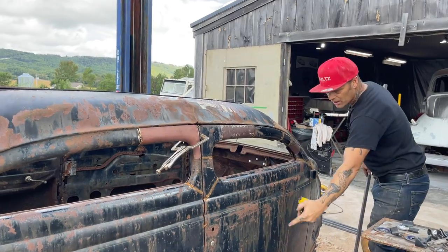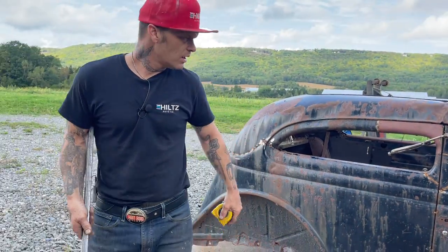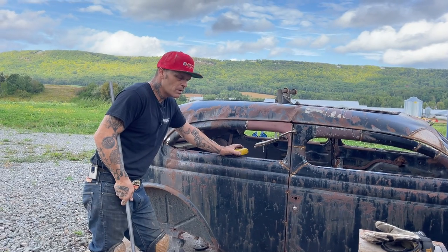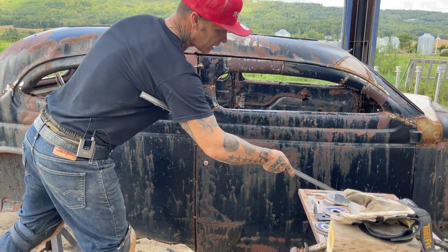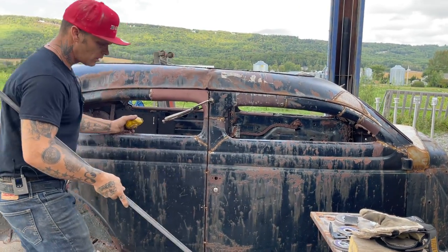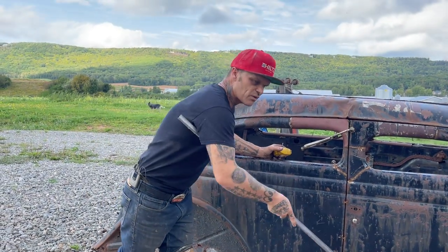Basically what you do is you try to get your doors lined up, square it up a little bit, get your door gaps going good, and that's the end of it. We want to put a floor in this thing, and there's three places that the floor connects to right off the get-go. You've got an A pillar where your door post goes down. That's very important. That has to be hooked onto that framework somehow. The B pillar has to be connected onto the framework, and your wheel wells have to be connected to your framework. And then generally the rest of it's all sheet metal work.